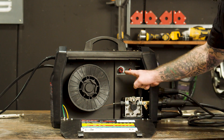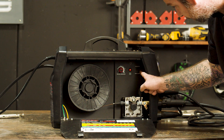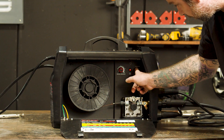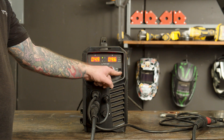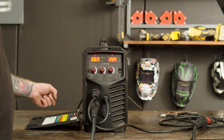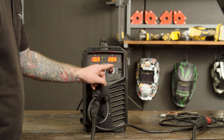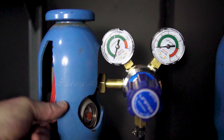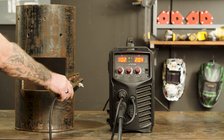Step six: MIG welding. The next step is to set your burn back. Burn back dictates how far your wire will stick out once you've finished your weld — I recommend setting it halfway. Also, set your spool gun/standard MIG switch to standard, and the selector switch on the front panel to MIG. There is a general guide on the inside of the machine on setting up your amps and voltage depending on the thickness of metal to be welded. Now that you've set your parameters, it's time to turn your gas on to around 10 to 12 liters per minute and attach the earth clamp to your workpiece. You are now ready to weld.